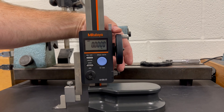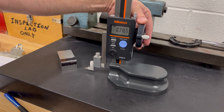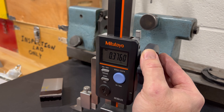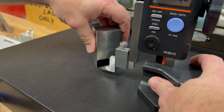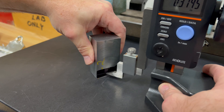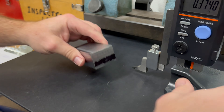In our case when we lay this out, we're going to be laying this one out at 375. So we go up to 375. We can lock it in place but we don't really need to. We scratch across gently, and if you need to go deeper you can go twice — that's not a problem. Nice contrasting line. Put it down, do the same thing, you can go twice. I'm going to flip it over and do the other side although it doesn't need it.